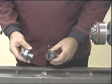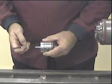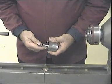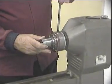To assemble the chuck, insert the top section into the base, align the 2 grooves, this will give a true centre, and tighten the grub screws. And this will ensure that the face runs true to centre. We will now fit the Wobble Chuck into a Patriot chuck fitted with standard jaws.